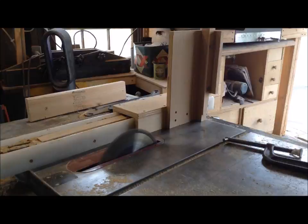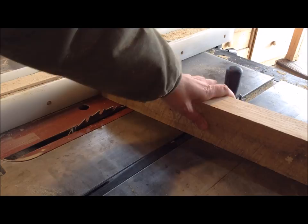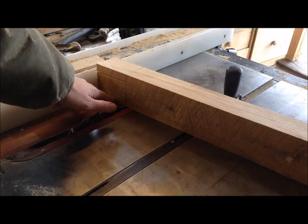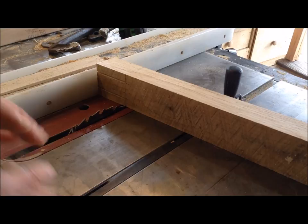In order to finish cutting these tenons, I set my miter gauge to 80 degrees, which will cut through that line that I want. I also moved my fence over to line up all of these and lowered my blade to just cut off this shoulder chunk. So now I could run all these through and cut off this excess, and then my tenons will be done.